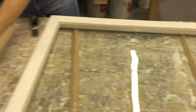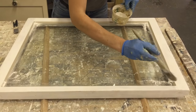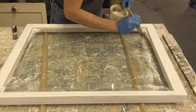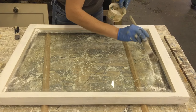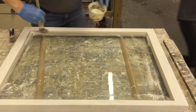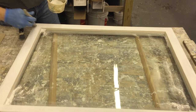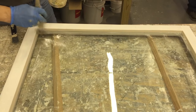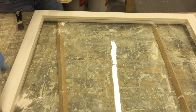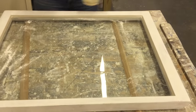Once you've got all four sides done, grab a little can of whiting — it's just ground-up chalk dust, available at some paint stores or online. In a pinch you can use drywall dust, like 10- or 45-minute drywall compound before it's mixed. This takes the oils off the glass, cleans everything nicely, and also starts the putty skinning off so it'll be ready for paint sooner. Use a soft brush for this, and make sure you get the whiting on all of the putty, but be careful not to disturb those nice clean corners. You can come back with a putty knife and clean it if needed.